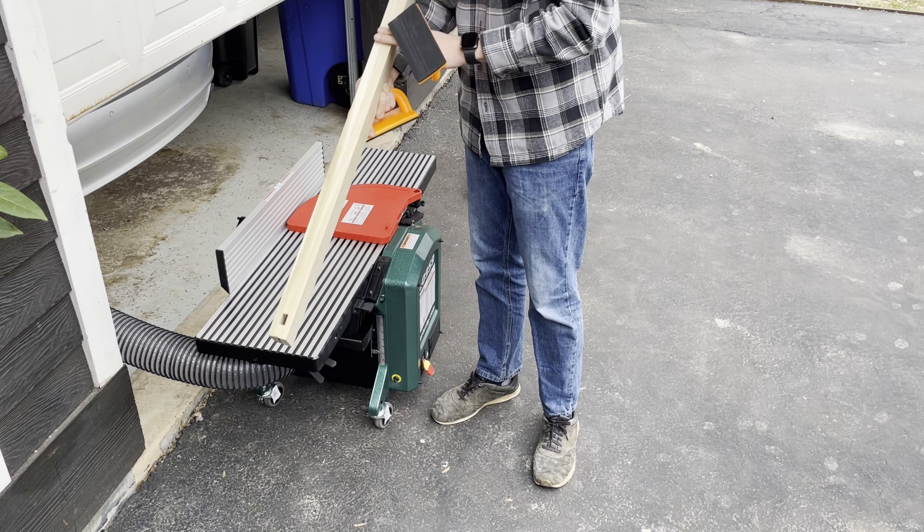One thing I found about removing snipe: like any planer it grabs in the rollers and pulls, and if you kind of hold it steady it avoids that tick. You can see it did a pretty good job — a lot less snipe lines. This is bird's eye maple, which normally gets chipped out around those little bird's eyes. I'm going to try it again with another smaller board, one of the later times. I want to see how I can smooth it out, do a regular planing, but also get rid of that sapwood on the edge. I'm starting out with 1/32nd cuts just to try it out.